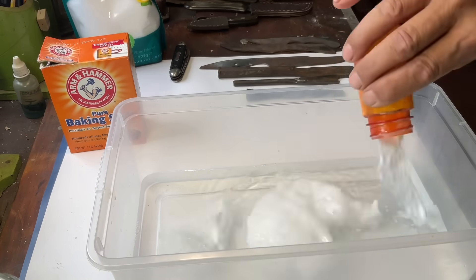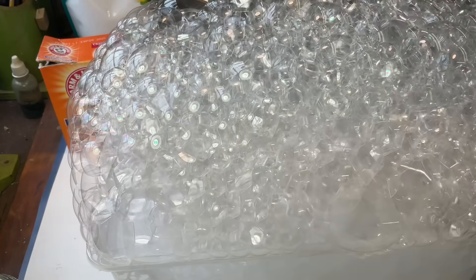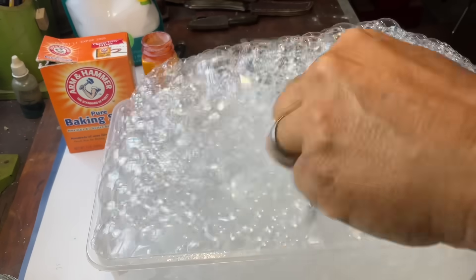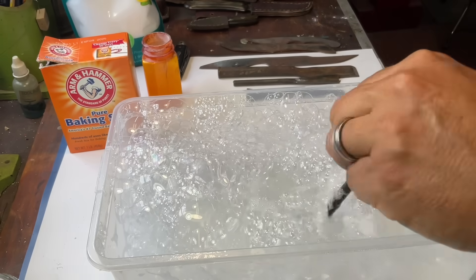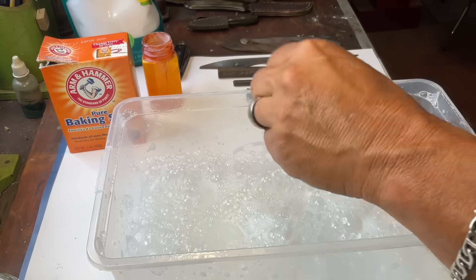When you add the baking soda it should foam — and yes, it foams really well! Hopefully it doesn't foam over... wow, look at that. Let me pop some of these bubbles so it doesn't make a mess. The big advantage to this solution is that it attacks the rust but not the base metal, which is the same claim Evapo-Rust makes. So if you're worried about preserving the base metal, this might be the solution for you.